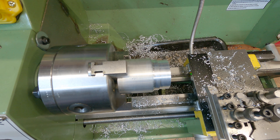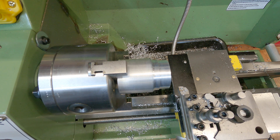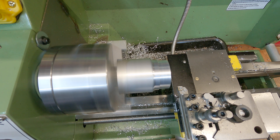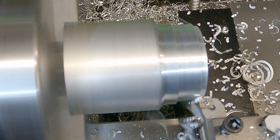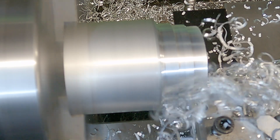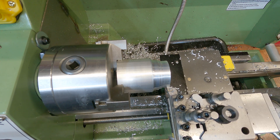I didn't want to push that all the way to the end - 1.25 millimeters is really really deep for this lathe. It seems silly to stop there, so I'm going to try going a little bit deeper. I'm thinking 1.35 millimeters, which will take off 2.7 millimeters from the overall diameter. This is going to be really noisy. That actually went surprisingly well, which makes me think I'll try a 1.5 millimeter depth of cut.